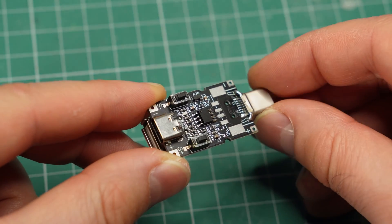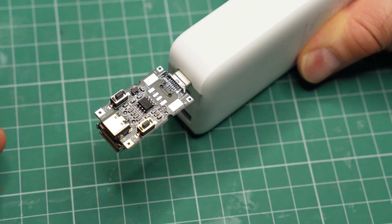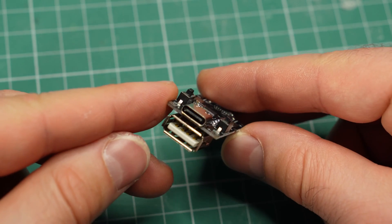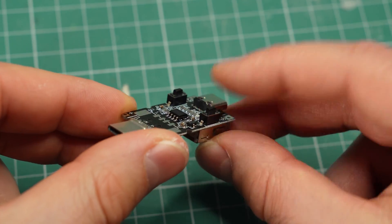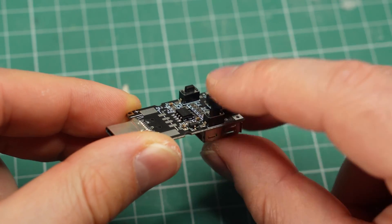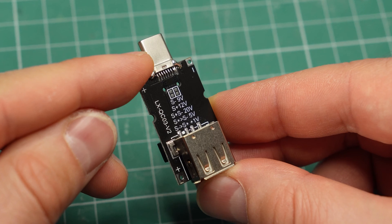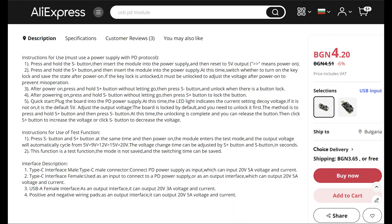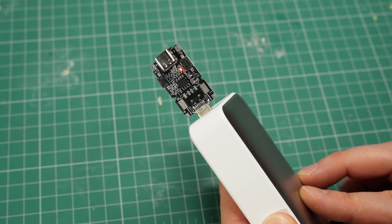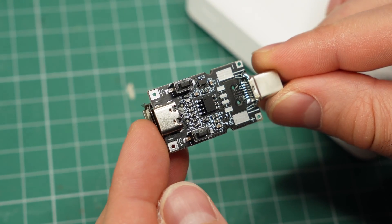The next module is kinda different. Instead of a female USB Type-C plug, it has a male input connector, so it plugs directly into the power source. On the output, we see two USB ports — one Type-C and one Type-A. This is a strange design choice. I can damage something by accident if I plug it into the Type-A port and I have the module set to more than 5V. Speaking of voltage, the module should be able to go up to 20V, but I was never able to get more than 12V, even after reading and following the long list of confusing instructions. I don't know if my unit is defective, but while testing it my power bank started acting up, so I decided not to bother with it anymore. I just can't recommend this module.